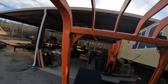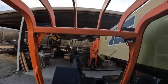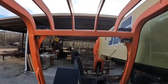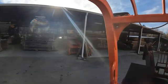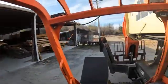Can't really see what I'm doing, so I'm kind of going by feel. Those slabs that are 30 inches or narrower will go through the Cantech double surfacer. The other ones will have to go across the slab miser. You can see a pine slab I was working on the other day.